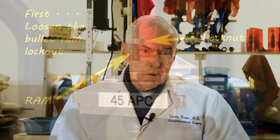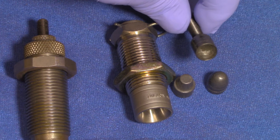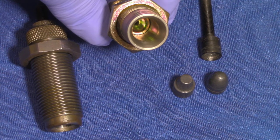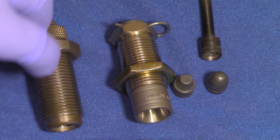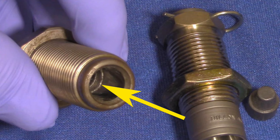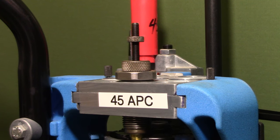This die is adjusted differently from number one because it's the die's center section that is moved up and down. A caution: some bullet seating dies also contain a crimping shoulder. This die's inner walls are smooth, but the die on your left has an internal shoulder. So if you screw the body of the die down too far into the die holder, you'll crimp your case into the bullet before the bullet is completely seated. You can usually feel this happening when you're seating your bullet, but if you're unsure, test whether the seating die is in too deep: simply back out or take out your bullet seating ram, bring the handle down to push the case up into the end of the die, take the case out, and feel to see if you have created a crimp.